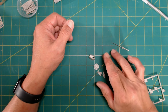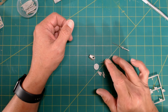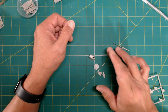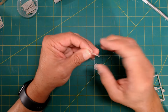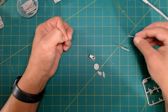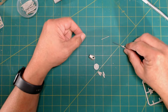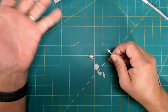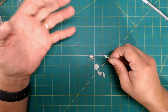And that's even with large pieces. But as you can see, it doesn't roll, it stops. So that means definitely there's either still a step or during my attempt to correct it, I left a flat spot. Something so thin, you really risk damaging this to an unusable state. So with that, I decided to take on the challenge of replacing the kit provided barrel with brass. And let's face it, nothing represents metal better than actual metal.